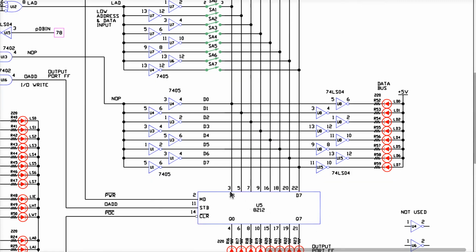What about this down here? These are all inputs. This latch has 8 inputs. It has 8 outputs. So it's not like this thing could have accidentally started outputting something on data bit number 5, and it does that, and then sometimes it does not do it, because remember, sometimes this LED does in fact go on. Okay, so this line is almost always low, but sometimes goes high.